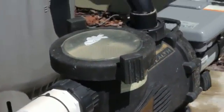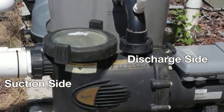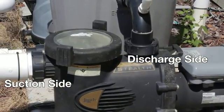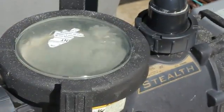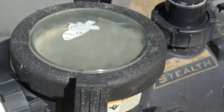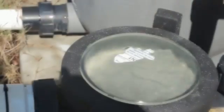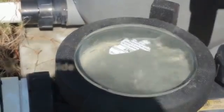For optimum pool pump operation, the source of the leak must be identified and corrected. Your swimming pool filtration system has two sections: the suction side from the pool to the pump, and the discharge side from the pump to the pool. Check the strainer pot of your pump. If you see significant air bubbles moving through the strainer pot, you know that the air leak is somewhere on the suction side of the system plumbing before or at the pump.